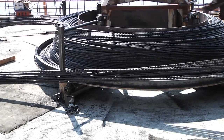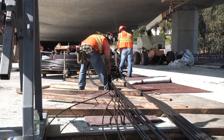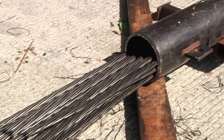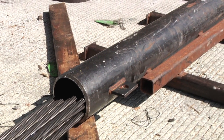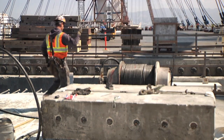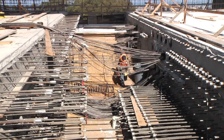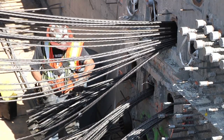There are almost a hundred different spools of strands of wire that we had to place inside this bridge deck. As we unrolled each individual strand, we pulled them about a half mile to the other side. On one end of the bridge we had a winch that did the pulling — we took a tow line, pulled it all the way through the inside of the bridge, connected it onto the strand, and then pulled the entire strand through.